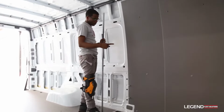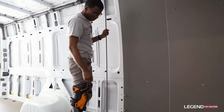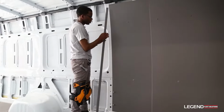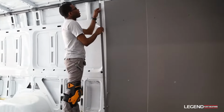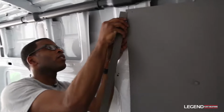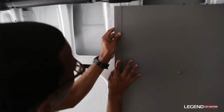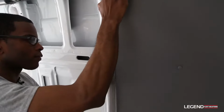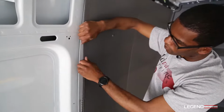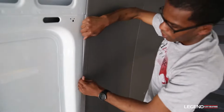After the front panel is installed and the insulation is cut back from the edge, we've got to install this H channel. I install it with the thick 1-inch strip facing out. Just clip it around the edge of the panel. Just kind of wiggle it around the edge till it catches.